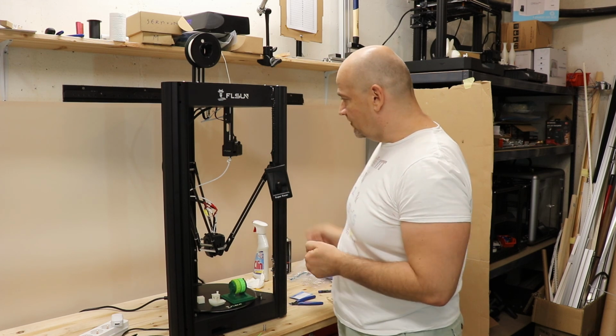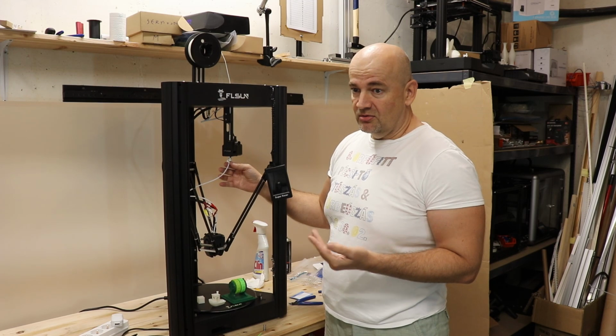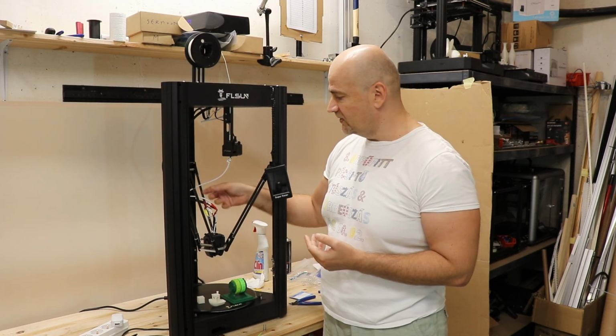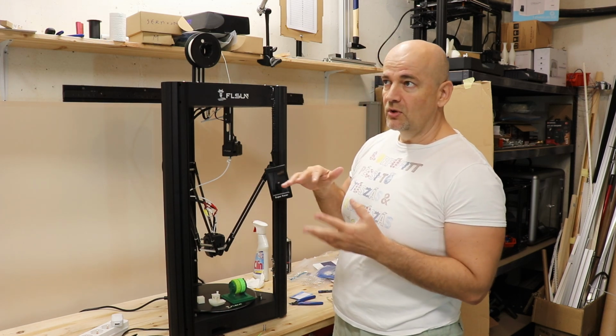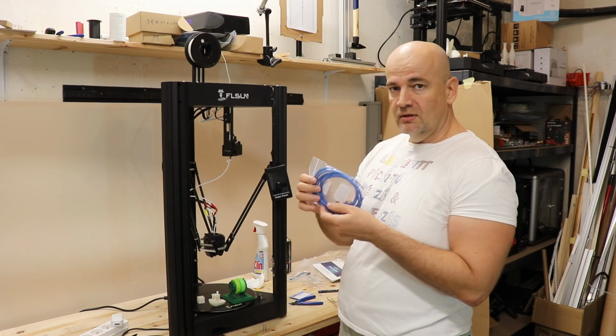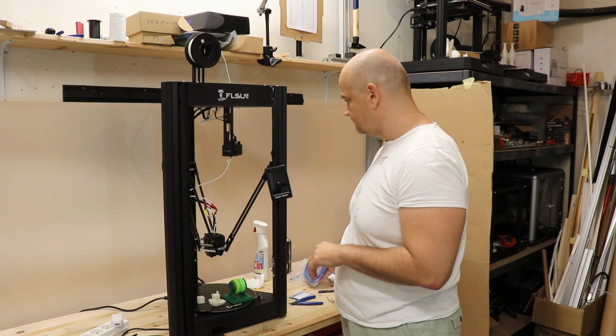The next one is this Bowden tube, which could be, I don't know, I think they could use some Capricorn Turbo or something like that, because it is more precise, and we could go a little bit above those 240 degrees Celsius. I already prepared the replacement, but I will leave this one for now. I want to see how it works.